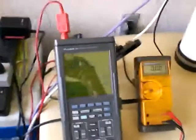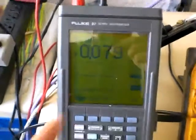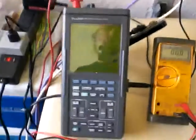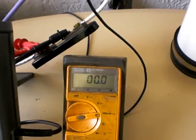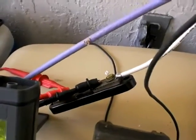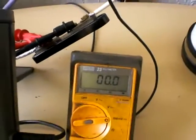There's my scope — I'll show you the waveform that's on there. It's going to be measuring DC; you'll see that there's a waveform right there, and if there's anything worth watching or pointing out, I'll point that out to you. This meter is going to be amps, but technically it's the millivolts from the shunt, so whatever reading you see from that, it's going to be one half of that.